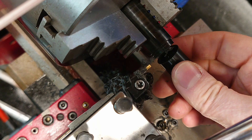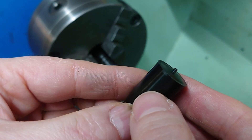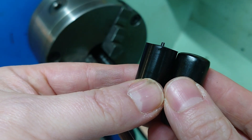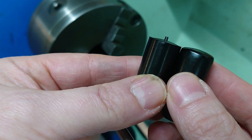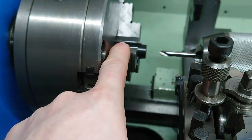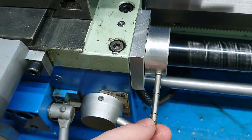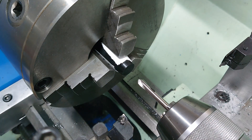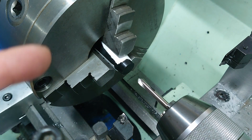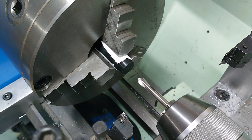I think I must be not quite on centre there, but it's probably a good thing it didn't completely break off. I can tidy that up on the manual lathe. The light's a bit better over here so you can see the dome it's attempted to replicate — let's compare side by side. It's partly down to my modelling of that dome that it may not be quite the same. Looks like I need more of a radius on this edge, a bit of a sharp transition. As this first attempt is not perfect, I'm going to use this one for the M6 forward/reverse control mostly just to see how it looks. I've got enough bar to make some better ones once I get the hang of it. That finishing pass with the parting tool on that radius isn't quite right, so I'm going to take another look at the model and see if I can improve that. But for now let's punch a hole in it and screw it on.